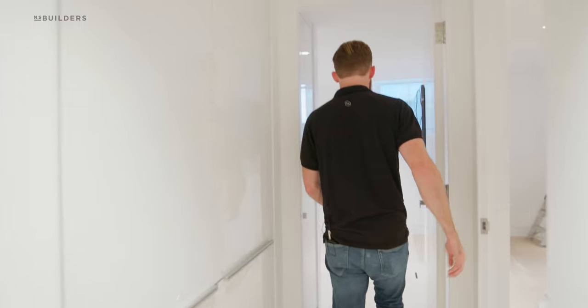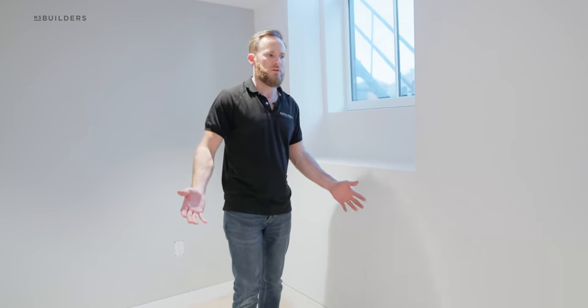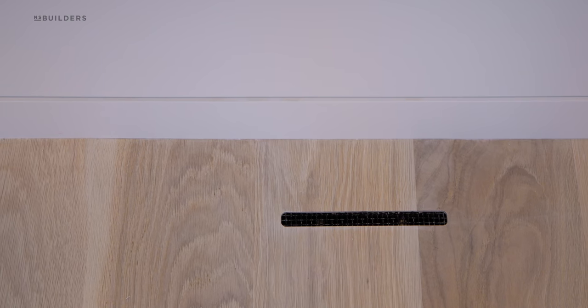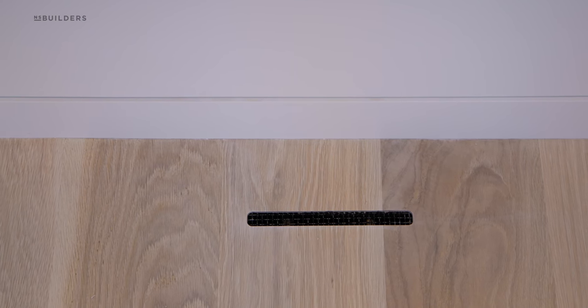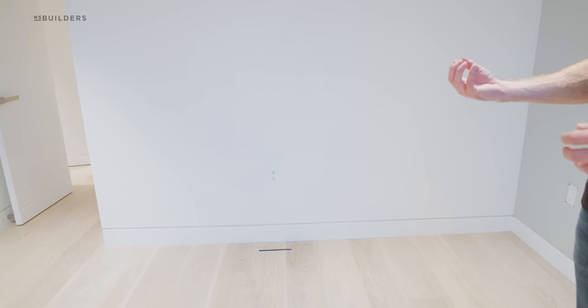We have our two guest bedrooms in here. This one was our first room that we had finished. It's just a really great room to appreciate the simplicity of the Trufig outlet plates, the recessed baseboard detail, the reveal detail with the shadow gap, and the HVAC registers — they were near a receptacle and were centered on it. If you guys remember, we routed that in the back of all of our hardwood and used an automotive truck grill material to create that black mesh. Now it is a high velocity system — it will not whistle. We worked with the engineer to make sure our boots leading up to the openings in the floor were designed by the same Unico air system. The grill was tested and sounds exactly the same as if it was coming out of that boot.